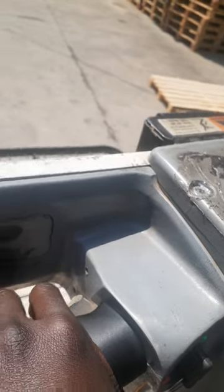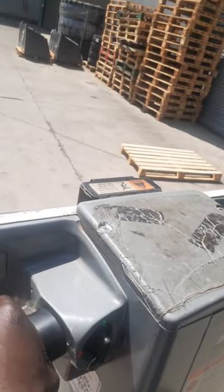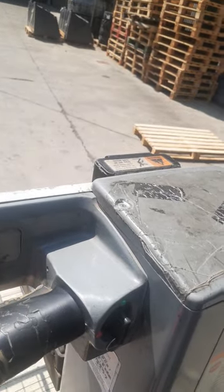This lever is our drive lever — it goes forward and reverse. This one is our steering lever — it turns right and left. These levers are sensible, meaning without your hands on them you cannot do anything on the machine. These are the lifting pedals. This is our hooter, this one is our rabbit, and this one is also a rabbit but it's a stop sign — it's just for lights.